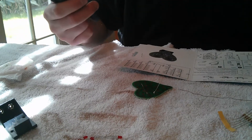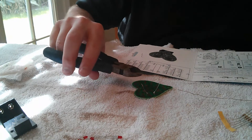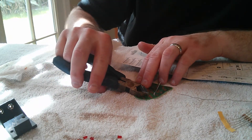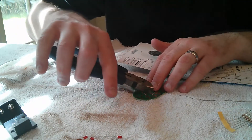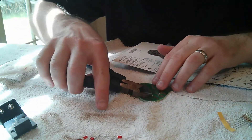After I get each component in, I'm going to trim the leads off. Give it a second for the solder to cool — you want to make sure the solder is cooled off so you don't crack the solder joint while it's cooling. Just go right to the top of the solder joint and cut off the extra leads. You can do this all at the end, but it's nice to keep everything out of the way while you're still working on the kit.